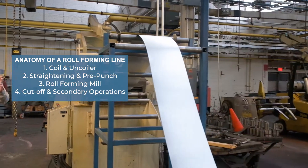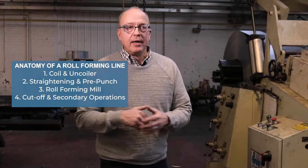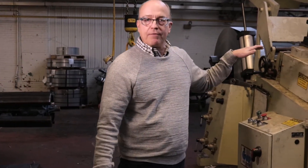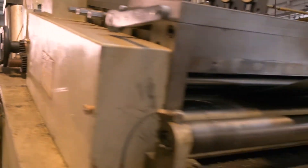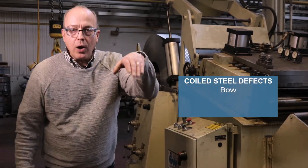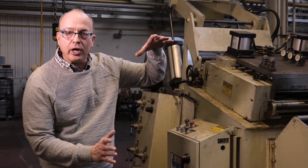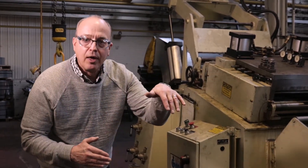Next will be step two: the straightening and leveling of the strip and the pre-punching. Part two is the pre-punching process, and I define it as two separate things. The first is taking the strip of steel from the coil and sending it through a coil straightener. When coils of steel are created, they have defects categorized as three different types. There's bow — created by the sheer fact that the steel is in a coil. The bow at the beginning is less because the diameter is larger; as it gets closer to the center, the bow becomes more due to the natural curvature.